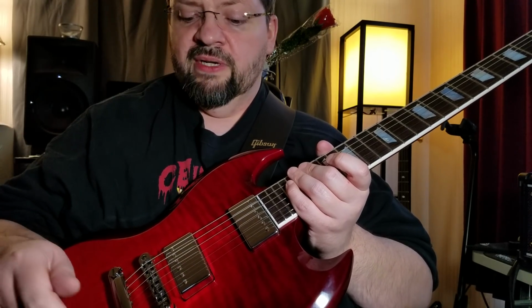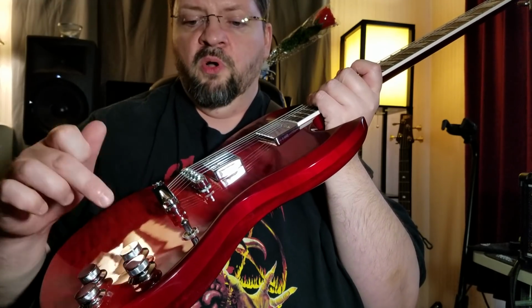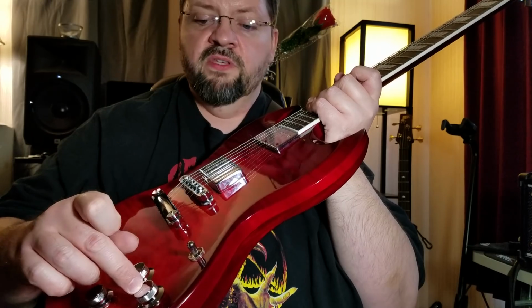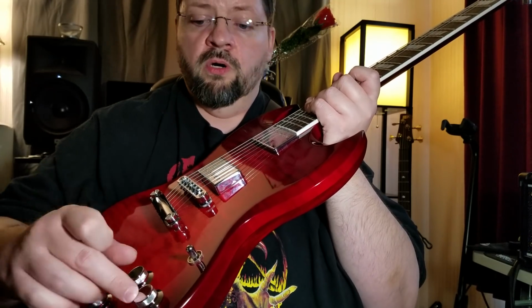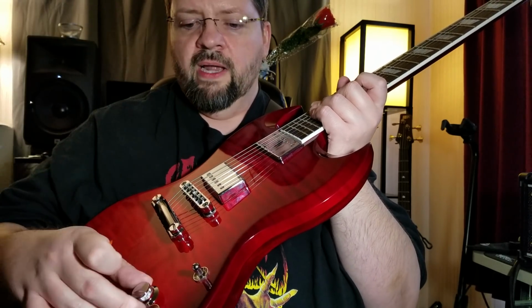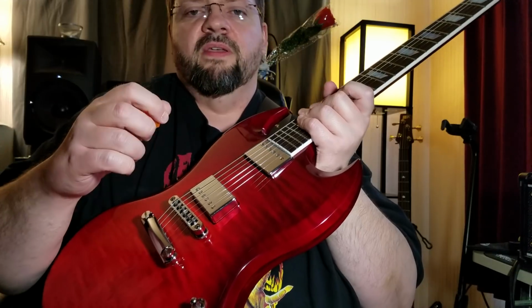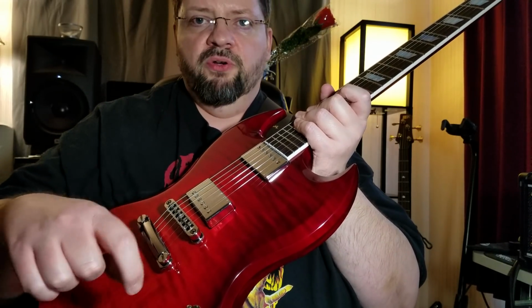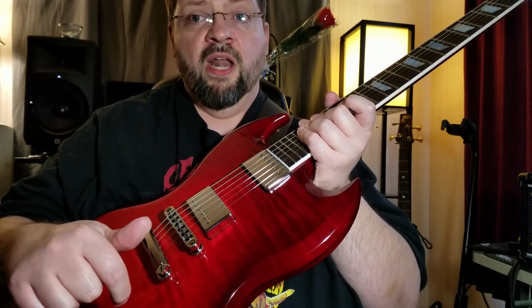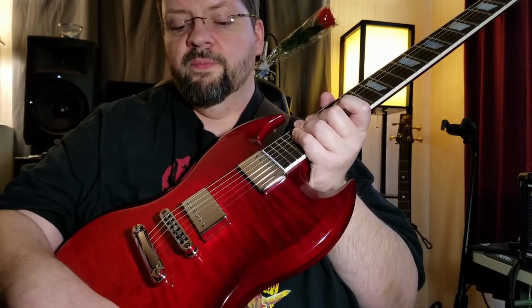The other switches that are in there can turn on a treble bleed circuit for both of these volume knobs, or individually. You can set it for this one and you can set it for this one, or either or, off, on, whichever setting you want. I kept the circuit turned off because for me, treble bleed circuits, I don't like the taper that you end up with on the volume knob. It seems to shut off abruptly and turn on abruptly when there's a treble bleed circuit engaged. So I left it turned off.